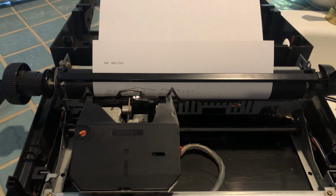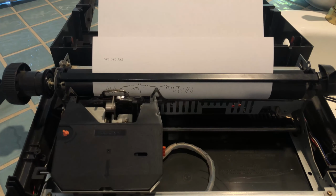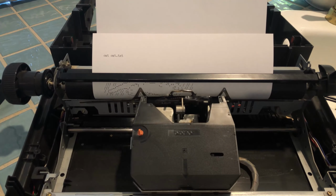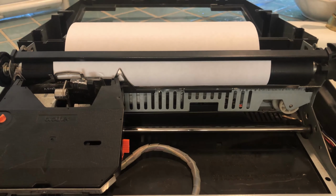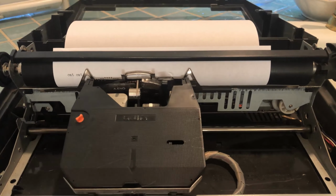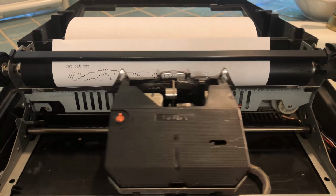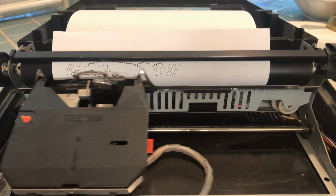text again. Even though I solved the problem of long outputs being cut off, some characters are lost whenever the Arduino sends an X-off or X-on. Apparently this is because the library I'm using, Software Serial, doesn't allow simultaneous two-way communication. Switching to the AltSoftSerial library completely eliminates this problem.